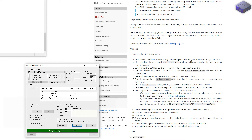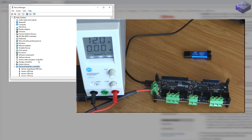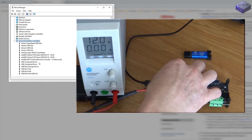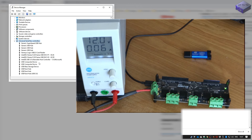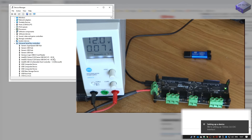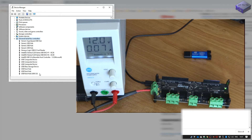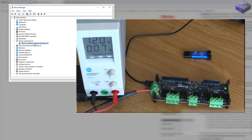Turn off the power to the ODrive and set the DIP switch back to Run mode. Power it back on — it sees it, perfect. Setting up the device, it can see it. It's seen it as 'ODrive version 3.6, CDC interface is set up and ready to go' — happy days! It's in LibUSB on interface 2.